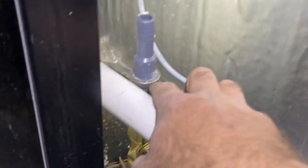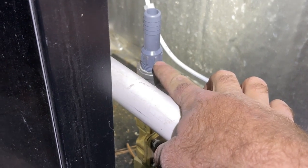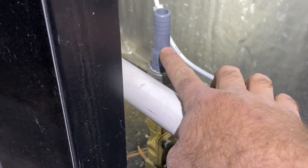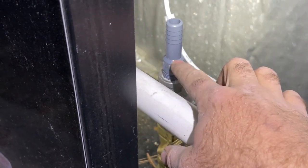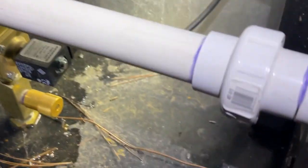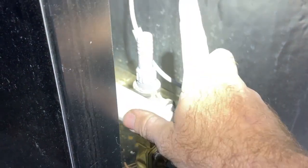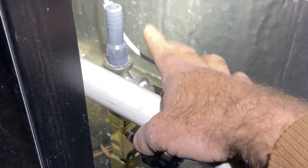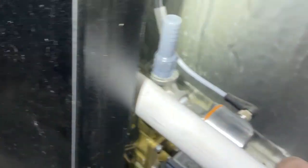I've already taken out the adapter in here. There's a little brass adapter that goes over to a compression fitting, and what several of us had happen was it froze right in here and it actually pushed the plastic compression fitting out. This is where the little black line comes off and feeds water down to the face of your pump. It's good that it pushed out because otherwise it would have cracked the brass fitting or it could have cracked this T below.